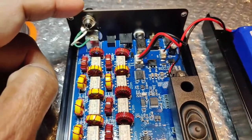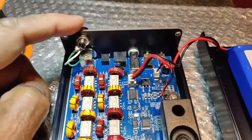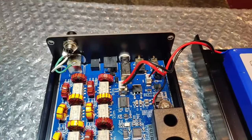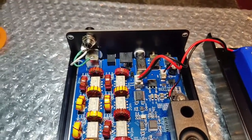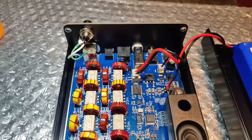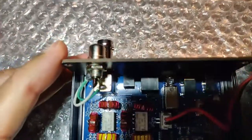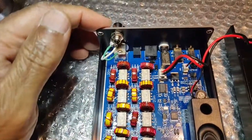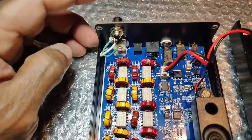The reason I used RCA is that most of the older rigs — at least the classic rigs — all have RCA output for amp control. I have made a homebrew control box for controlling up to about six rigs, and I can control up to about four amplifiers at any given time. All have RCA, so I added RCA jacks there to keep it standard — that's the reason I made a provision for RCA here.